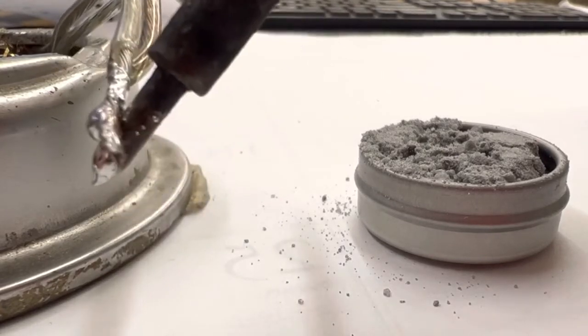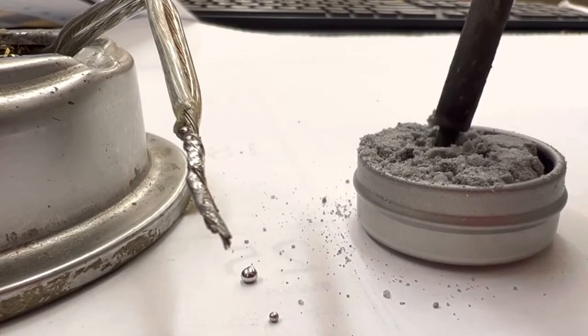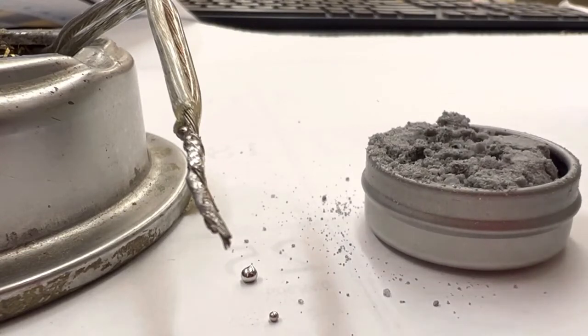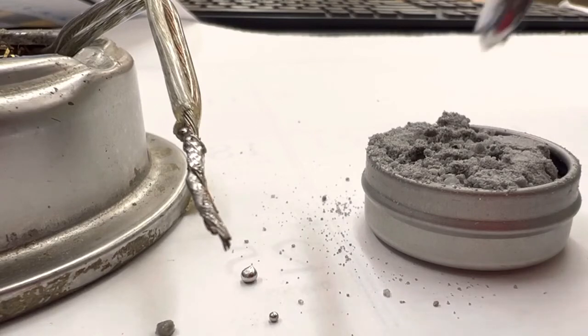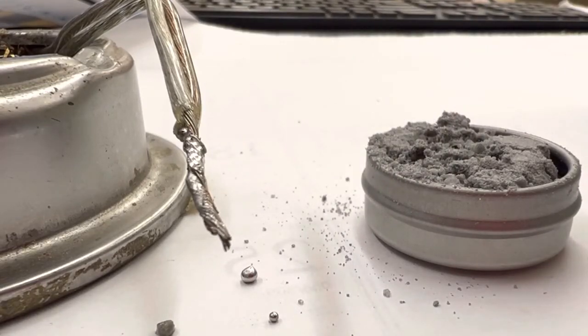If you have a little too much solder on there you can always heat it up and tap it off — it comes off pretty easy. That's soldering two wires together. And again, always clean the tip — I'm gonna put a blob of solder on there, just a drop, and put it away. Just that much solder and put it away so it'll stay clean.